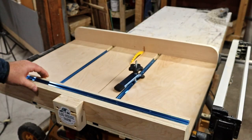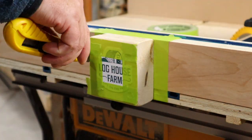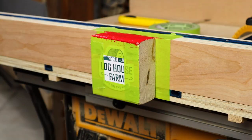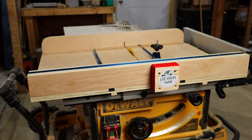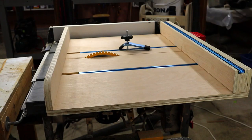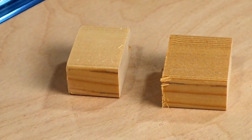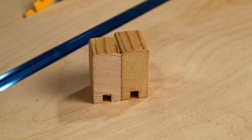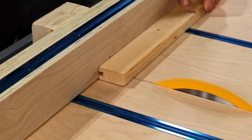There's just one more thing I want to do. I'm going to add a little bit of red paint, just as a reminder of the danger of putting your fingers where they should not be. Everything's done now, and here's the difference between a miter saw cut and a crosscut sled cut. The sled produces a much cleaner cut — they're both nice and square, but the sled does such a good job of making a clean cut.